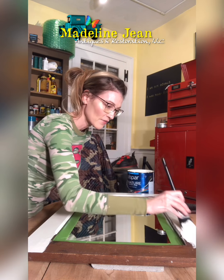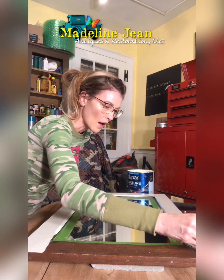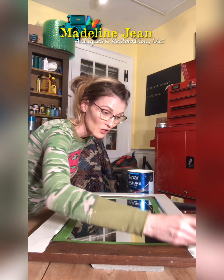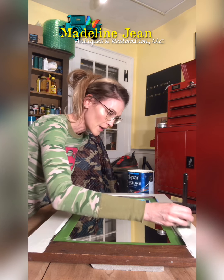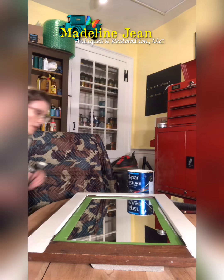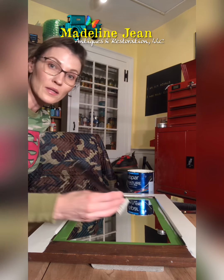After that, if it's dried, you can try picking out stuff like brush bristles. I've picked them out with tweezers and a needle. Not kidding you, that seems to work. Again, I'm going to bring it from one edge to the next. There we go. So in between my coats, as I was trying to explain to you, I will sand.